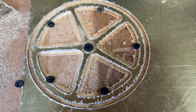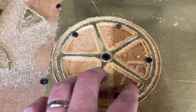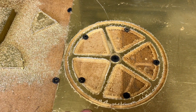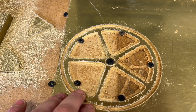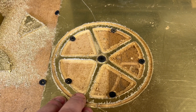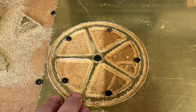We've got the blank out now. Obviously a lot of you will be shouting that I've done this the wrong way around — I've crossed out, which reduces the strength of the wheel. So we're going to put this on a backing plate. I've done this before and it works okay, but never with a wheel this big. We're going to mount it on an aluminium backing plate, get it all nicely centred and round, then put it on the mill to cut the teeth.